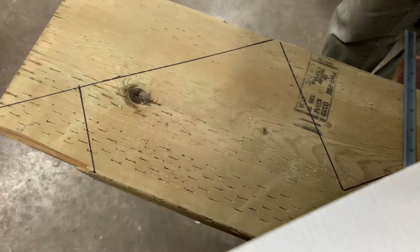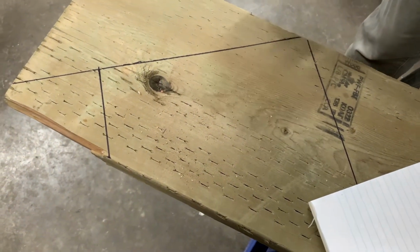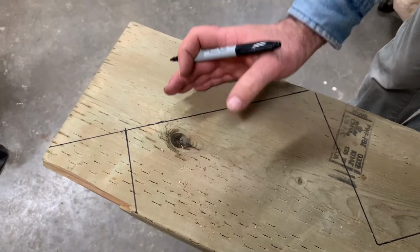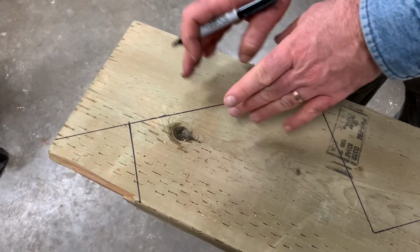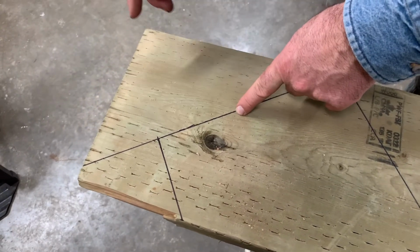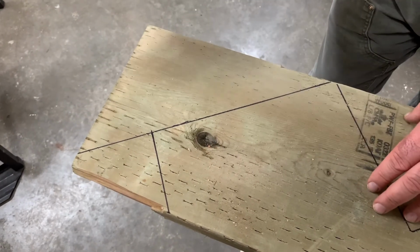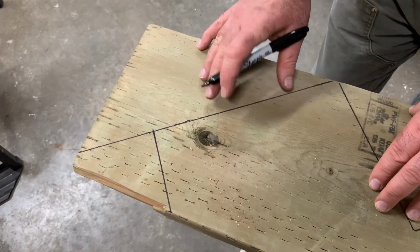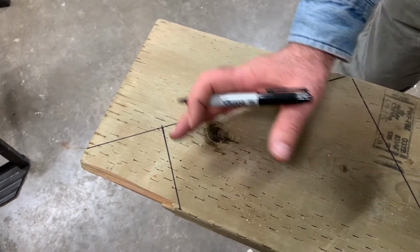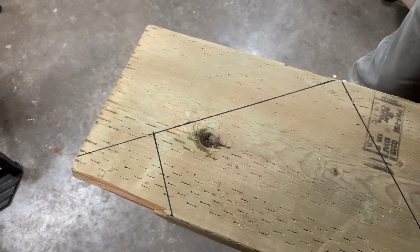And since we want a consistent rise figure, we need to remember that there's going to be a stair tread on here, and you'll need to take that into account. And how you take it into account depends on the thickness and whether or not your measurements take you up to the level of the finished floor, as they should. But you may need to alter this position to preserve that all-important consistent rise figure.